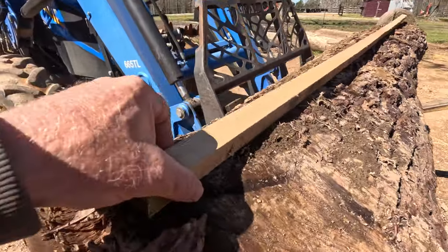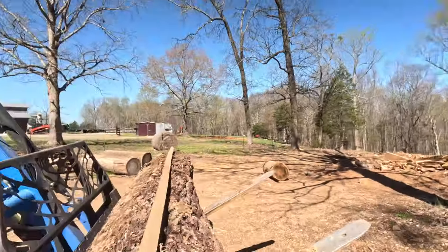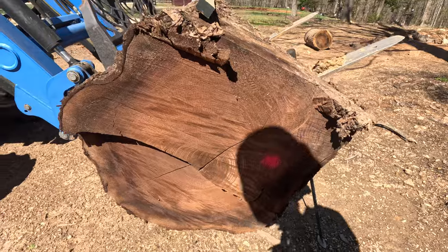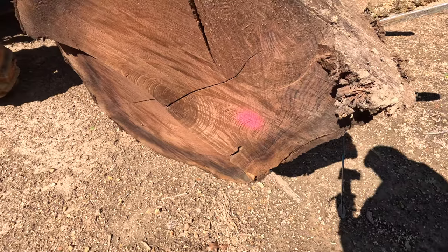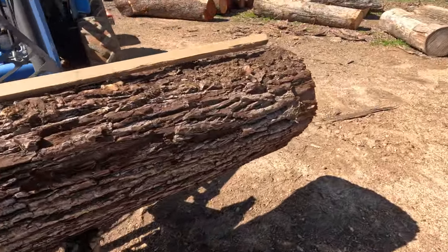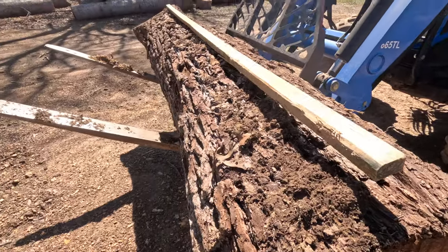If you look at this log, you notice when I put my eight-foot six-inch measuring stick on it, I've got a little room for end trim here, which is what I want, because I've got some obvious issues right here. When the loggers cut logs for me, they will typically put a little spray paint on it so I know that's mine — that way when it's getting sorted out, they know those are mine. If you look down the length of the log, you'll see how long it is. This one's cut just about perfect for me. I've got a couple of inches of end trim on either side, which lets me make my adjustments. This is really the kind of logs I like to get.